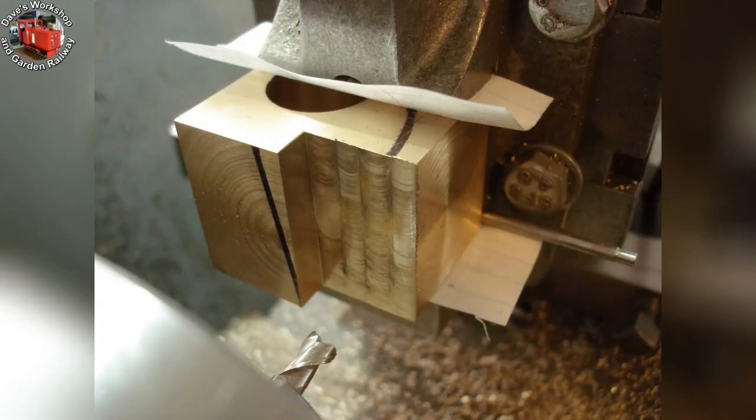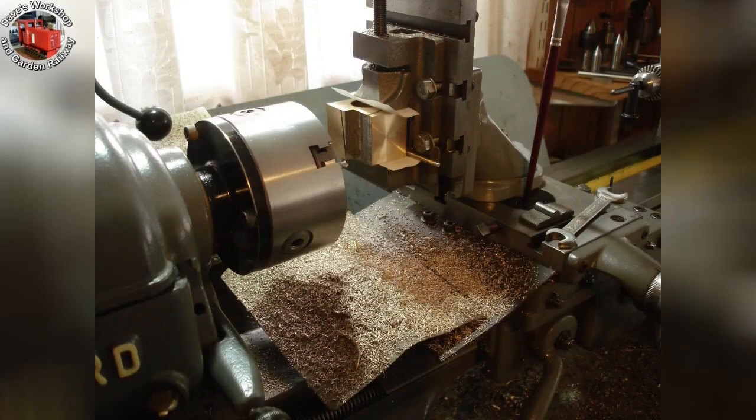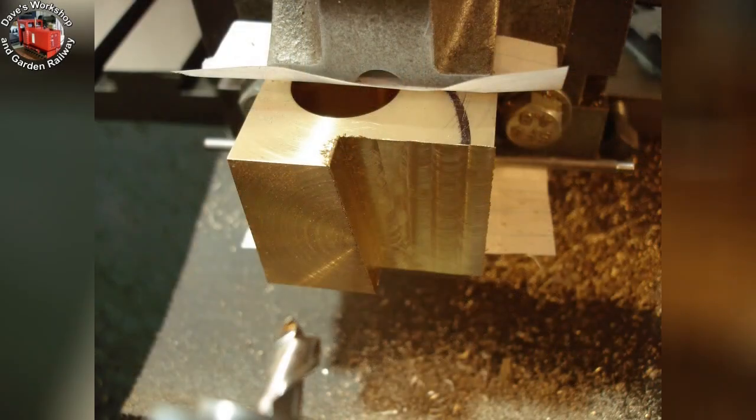Here's the face after all the straight up and down cuts. There's a lot of swarf. The angle has been generated step by step. It took me a long time to realize why tilting my swivelling vertical slide over by the required 8 degrees would not result in the angle being generated. The answer is because the machine vise is still perpendicular to the axis of travel.